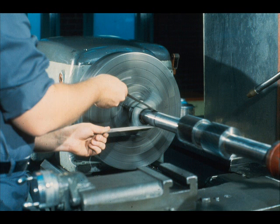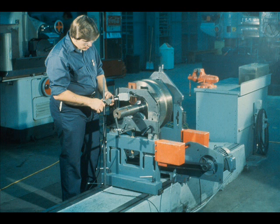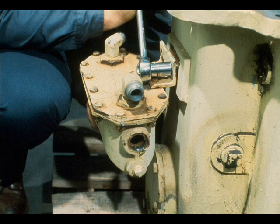With the gear assemblies mounted between centers in a lathe, polish the shaft journal fits, and indicate these fits for run-out. In some cases, it may be necessary to check the balance of gear assemblies if prior investigation warrants it. Inspect the lube oil pump, paying particular attention to the gears — repair or replace as required. And service the oil cooler if your model is so equipped.